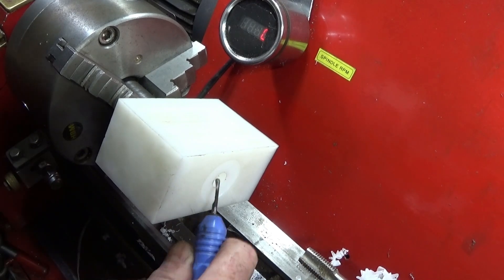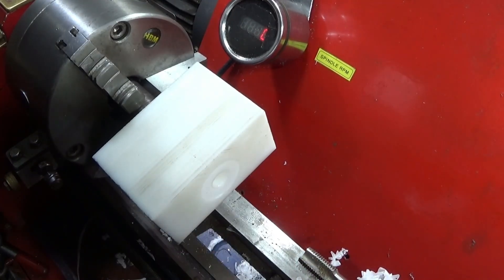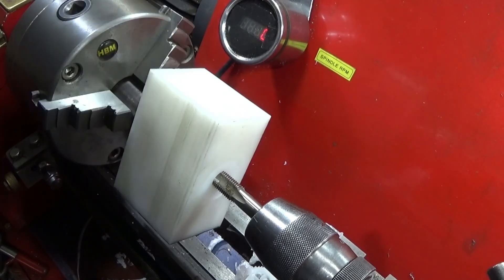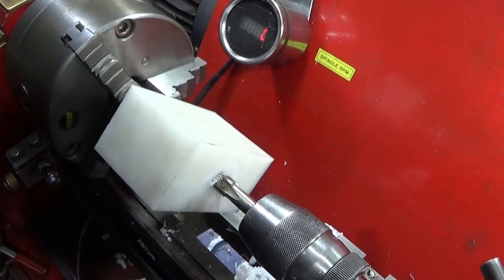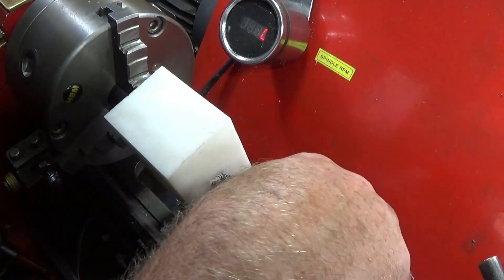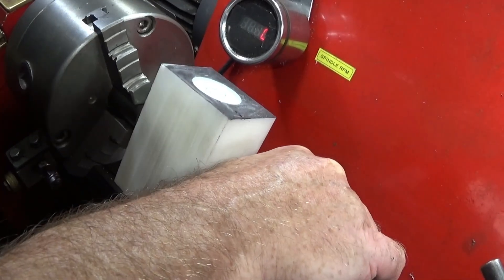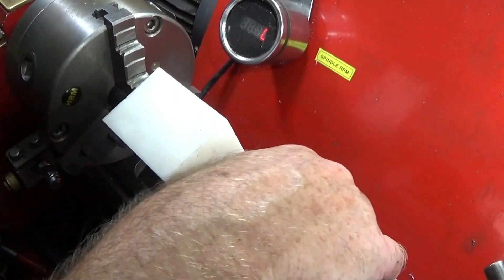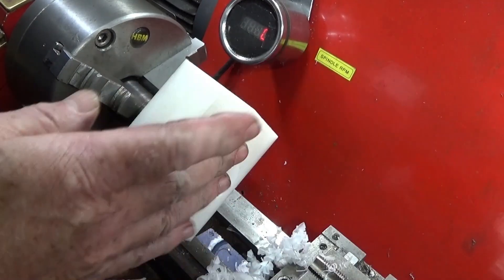This is why I have the habit of tapping on the lathe like this without using the spindle power. When you come to reverse using an ordinary chuck it spins the tap, and I have to tighten it so it stays in there. Also, if I was using the power it might unscrew the component off from the union — so that's why I do it by hand. Then I can finish that one off in the vice.